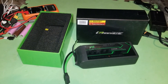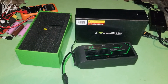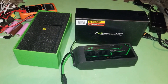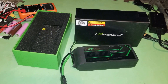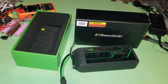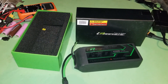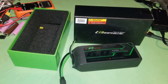The number one reason I chose these particular batteries was performance. I'm intending to do some riding on the local ice race track this winter, so having a battery with very low internal resistance seemed the way to go. The performance characteristics I saw online showed very little voltage sag under load, and that's definitely proven to be the case in my ride tests. They're rated at 75C continuous and 150C for bursts, and that performance stacks when you put them in series.